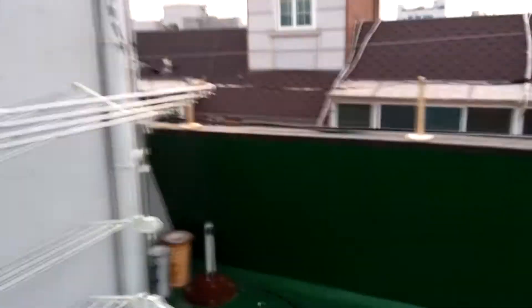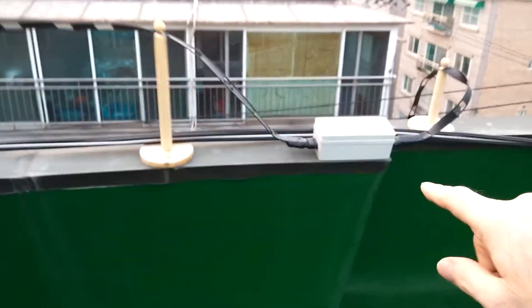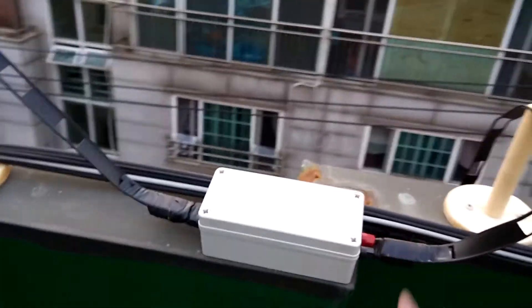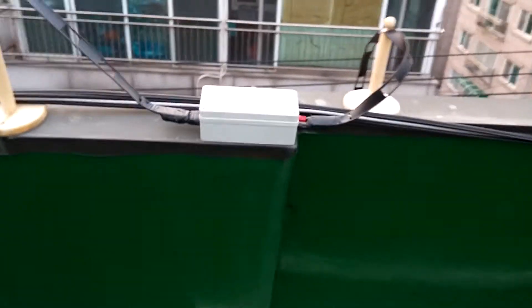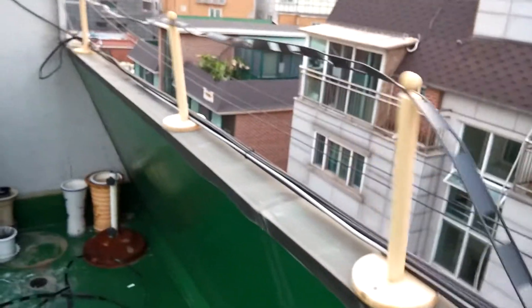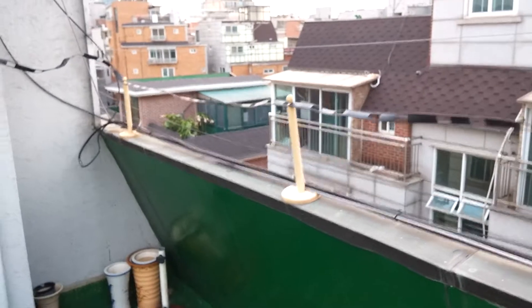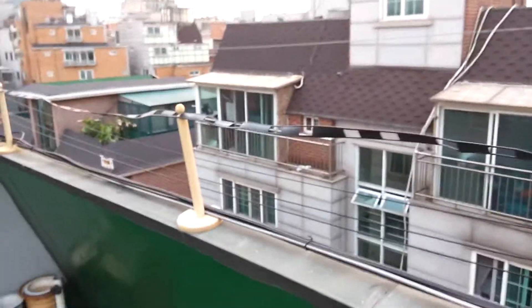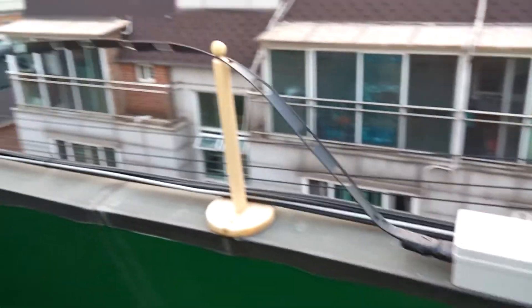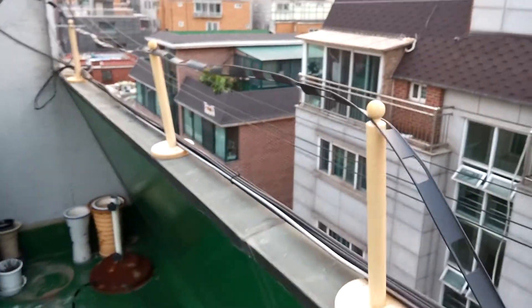Fed with ladder line all the way down. Paper towel standoffs one foot away. It goes down here to a disconnect in case I have lightning or storms coming, and then goes back down the building. As long as I'm a foot up from the metal — the copper cap here — I've found that it doesn't mess up my SWR. If I'm closer than that, it starts to make problems. I had it on some smaller toilet paper holders and it made issues, so I had to raise them up at least a foot.